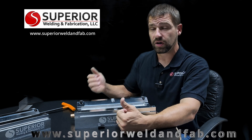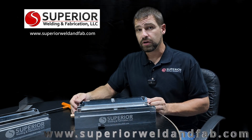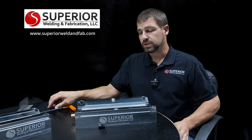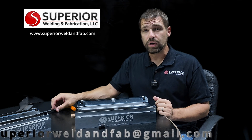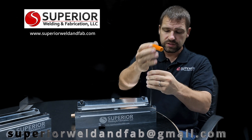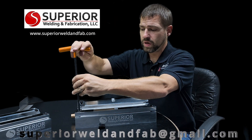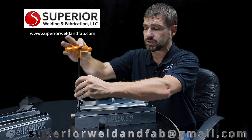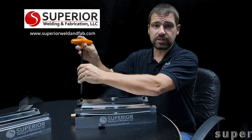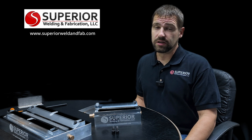Commonly we get people who do six-inch individual pieces, so six by twelve, making it twelve by twelve when done welding. This is four by twelve which gives you eight by twelve when done — it fits in here very well. With our 0.125 aluminum, you simply undo it and it comes right out. We also have optional steel hold-downs if warpage is a concern for you to help hold these down. So far over all the years we have yet to break a single one.